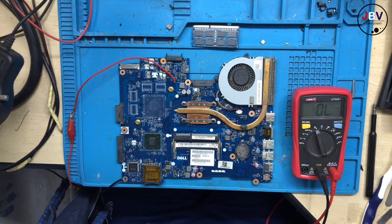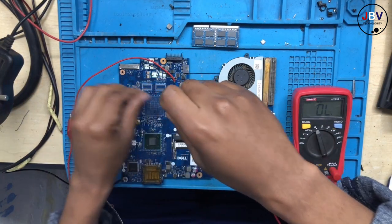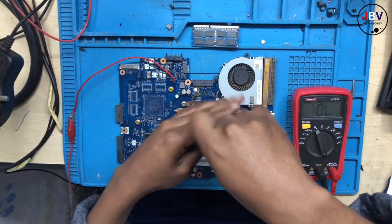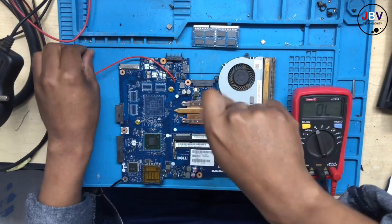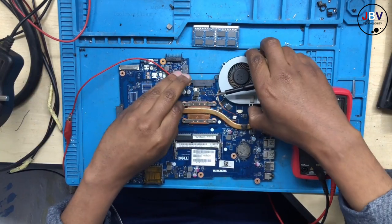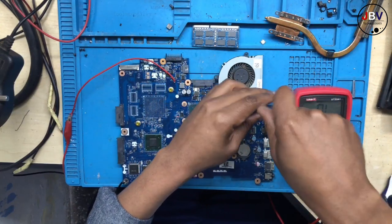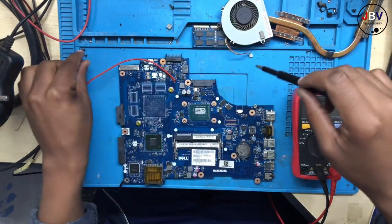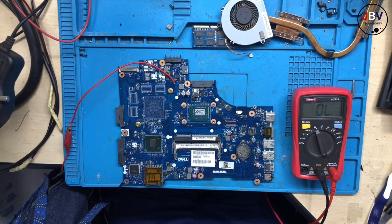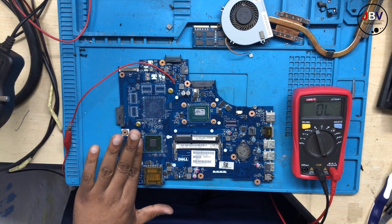You can see the numbers. Oh, wait, before I even inject any volts, I just want to remove the heatsink. I don't want anything to distract me when I'm finding a short. All right, let's go ahead. Let's inject some volts. The 19 volts has been dropped.